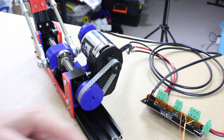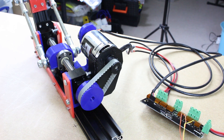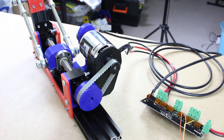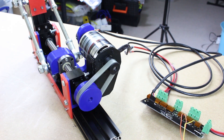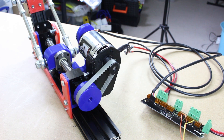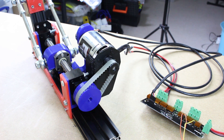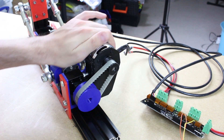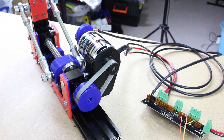We've got the encoder on the back end and that's working okay. We've got our O-Drive hooked up again — check out last time's video for more about the setup. This now works. I've tuned it up to 30 amps — it was set to 10 — and I've tuned up the maximum speed as well, and had a go at the PID settings. It seems to slow down quite well without overshooting, which is quite good. We've also got holding power on, so if I turn it, it'll turn back. There's absolutely no chance of back-driving this mechanism.